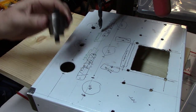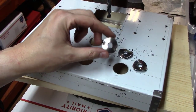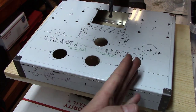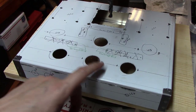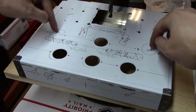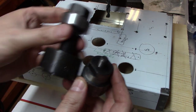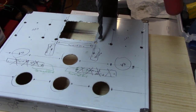Check out the little slugs that come out when you punch them. I've now got four beautifully cut holes. I always wait to drill the mounting holes on the outside after cutting the big holes — just in case one shifts a 16th of an inch left or right, you still have a chance to adjust on the mounting holes. We've still got the two larger holes for the 807 sockets to do, so I'll jump up to the next size punch. The bolt in the center of that one is about three-quarter inch — it's getting up there.